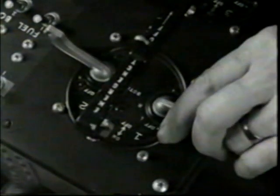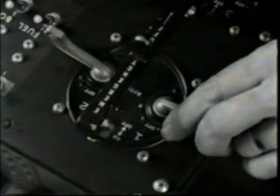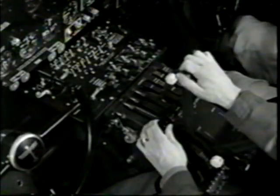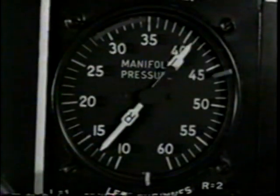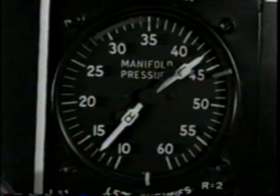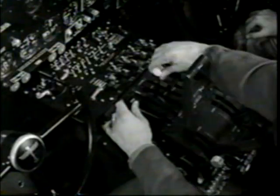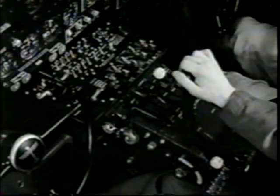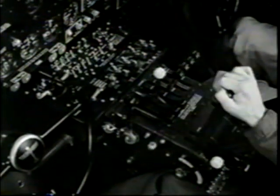Roughness doesn't always give you a quick drop in RPM. Throttle up to the stop — a quick check of manifold pressure and then full turbo. Since you're using 91 grade fuel here, you can't draw 46 inches; power's cut about 10%. Set your lock. Check RPM — a little below 2,500 on this fuel. Take a look at the engine — everything okay. Back slowly on the throttle because of the induction backfire hazard. Same procedure on all engines.